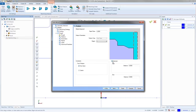Now the extensions, I like to use extensions on the front face because it allows me to have the tool come in a little early. Instead of it just meeting here and plunging down, I could say start an 1/8 inch higher than the part, feed to where your position is and then make your cut down. So I like to do a distance above.